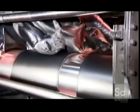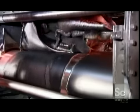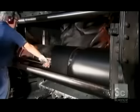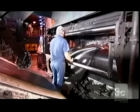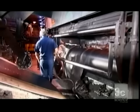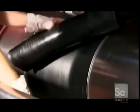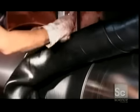The mixing generates heat, which softens the rubber, making it doughy. The rubber dough then flows between rollers that squeeze it into a sheet. This process is called milling. They slice the sheeted rubber and feed it back into the machine several times. This repeated milling essentially kneads the rubber to give it the right consistency.